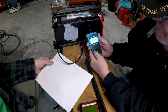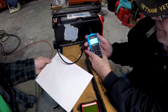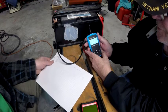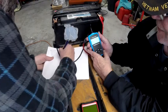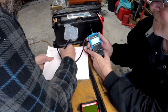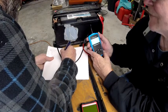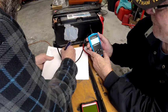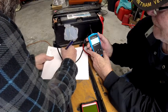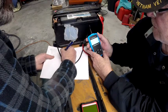The second meter is testing in the same mode with the same bar display. The results are right on: health 25 percent — same as the last meter. Charge is 76 percent; the other one said 73. Cold cranking amps is 425 — identical to the first meter. Internal resistance is 7.07.